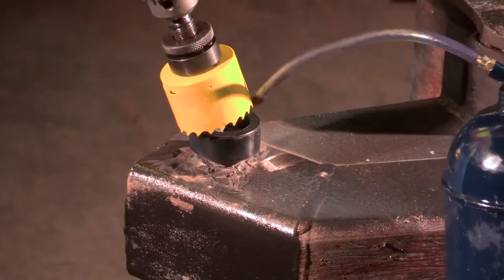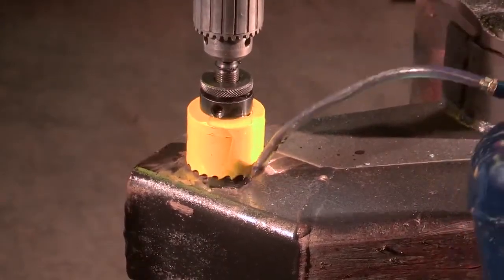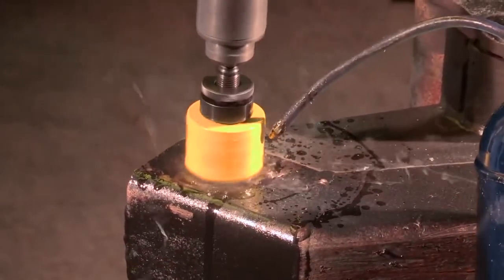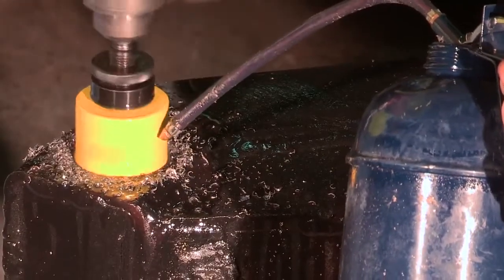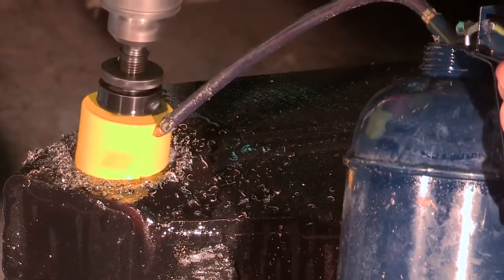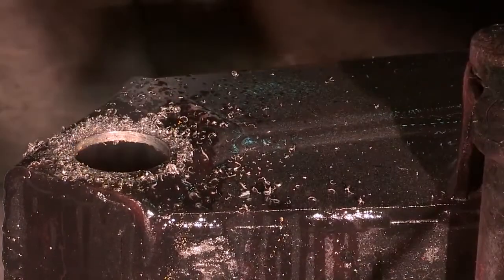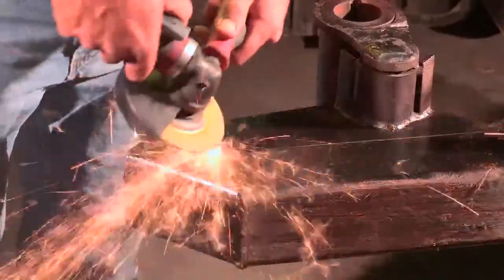We use the bore guide to start the process and maintain an oil bath to keep the surfaces slick and cool. Once we have the boring groove started, we remove the guide to complete the boring process. Bair supplies a hole saw and arbor attachment to achieve the proper depth to penetrate the frame over the stub. Once the boring through of the first side of the frame is complete, the same process is repeated on the other side of the frame.